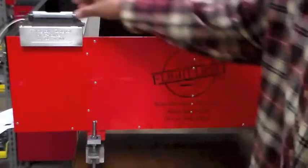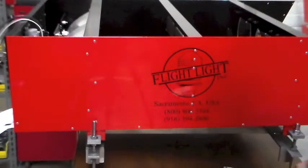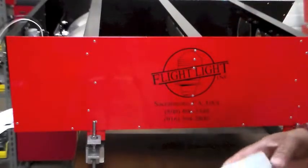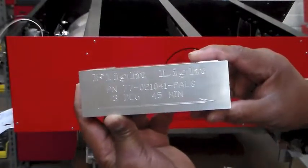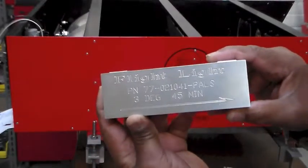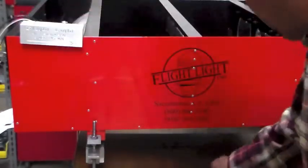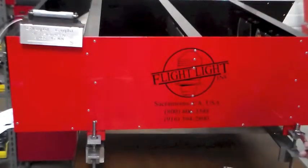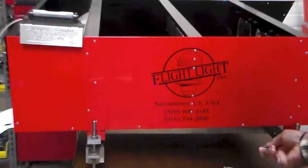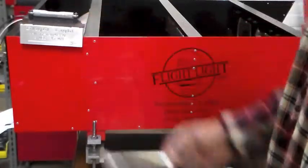Once you have found your zero reference, you will remove your level and your aiming device, and then you will place your three degrees and forty-five minutes aiming device, which is fifteen minutes below your glide slope. Place it on your LHA, then place your level and adjust your second box for three degrees and forty-five minutes when you have your level centered.